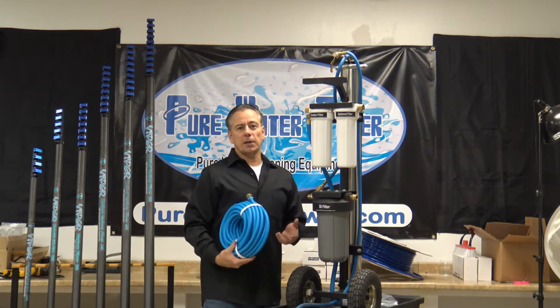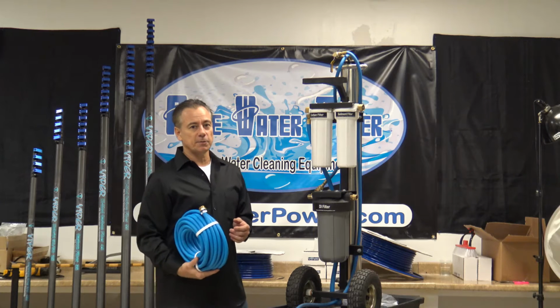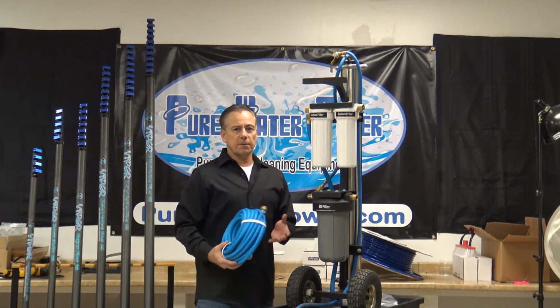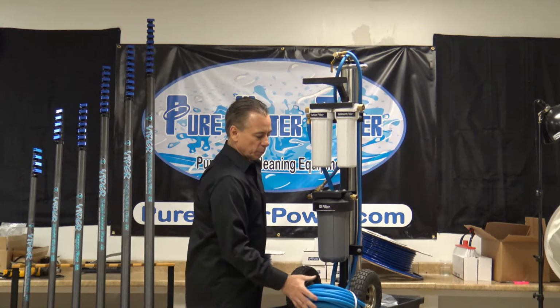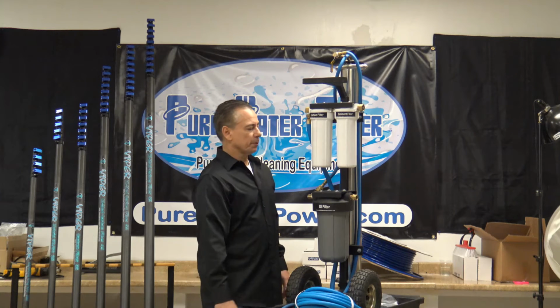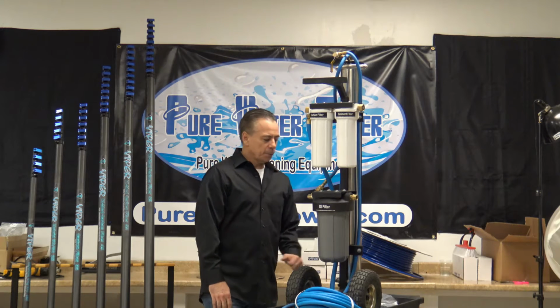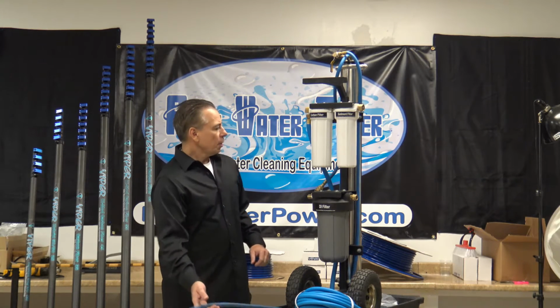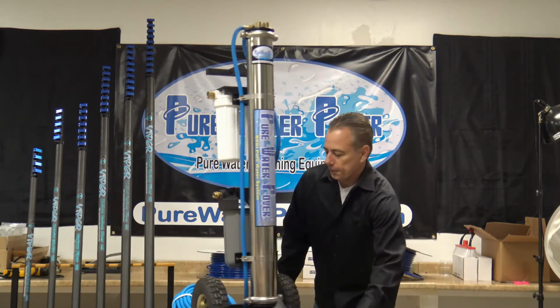And so we highly recommend that you use something like a regular garden hose, something 5/8, 1/2 inch even if you can, but 5/8 is definitely recommended. So that's just a little tip because it can decrease your water flow. So that is basically the 4 stages. Now, with an RO system, and this is the RO filter, the big one in the front here.